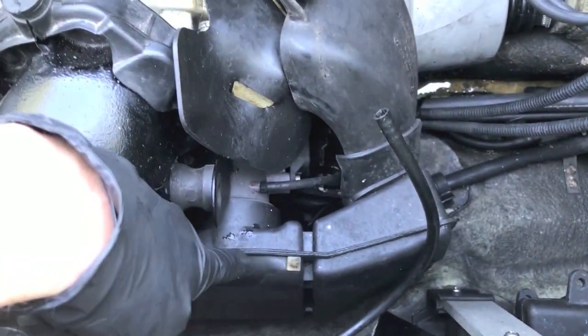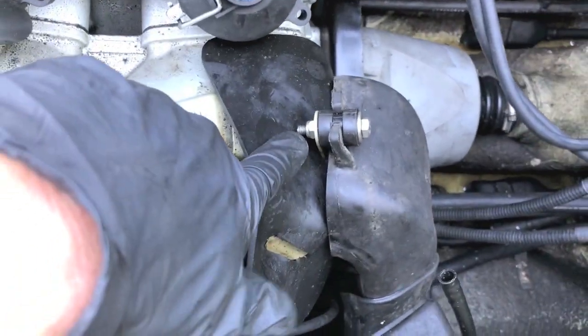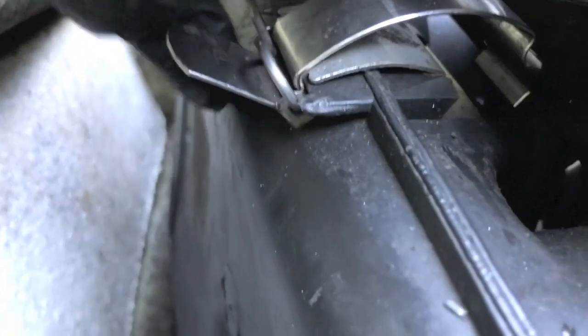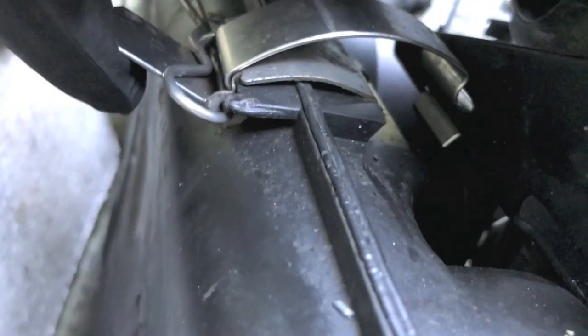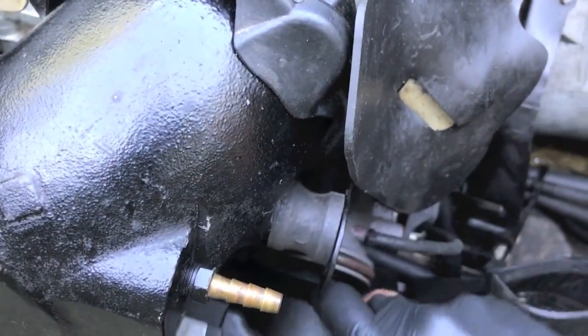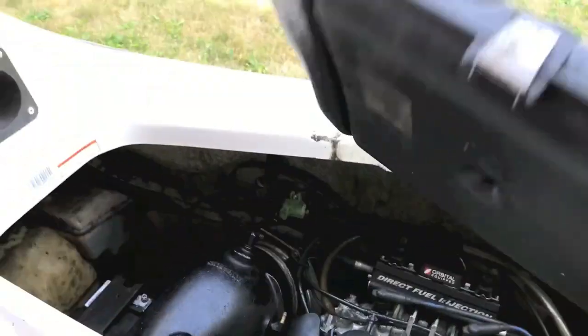For the fourth bolt, the lower left-hand bolt, we actually have to remove this lower plastic case down here — don't stress out, it's very easy. There's a 10-millimeter bolt here and the nut on the opposite side. Both bolts are removed. Carefully shift each plastic part up and set those aside. Down on the very bottom you will see a little clamp with a cotter pin or safety pin — go ahead and remove that and pop this little tab up. The pin is removed and the tab is shifted up — carefully remove this entire piece from the hull.